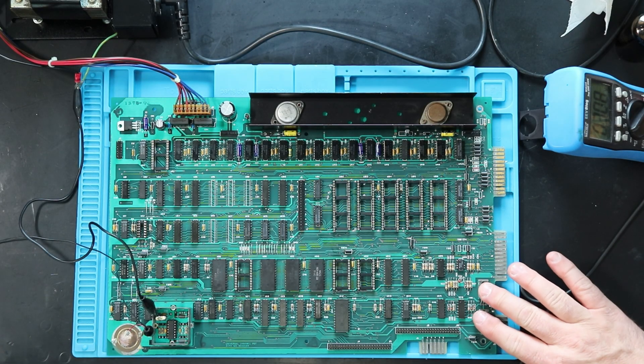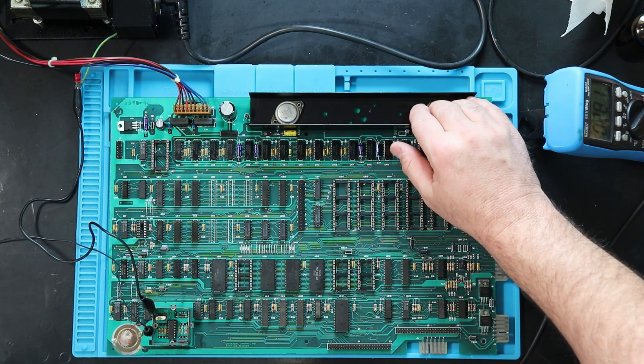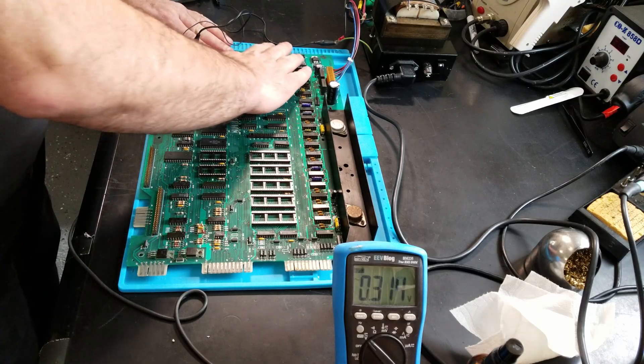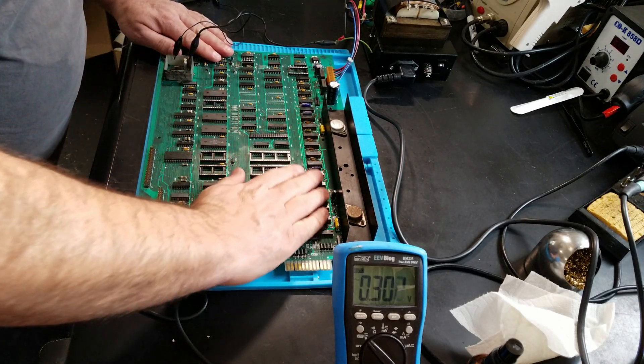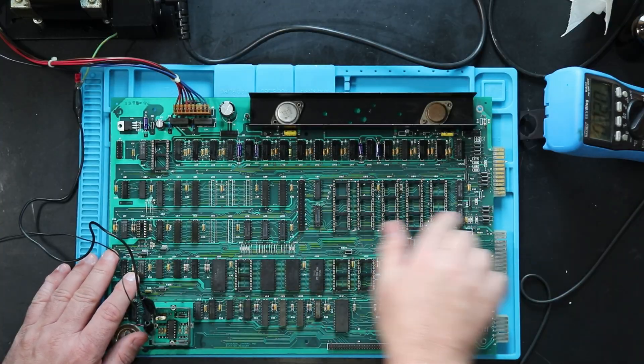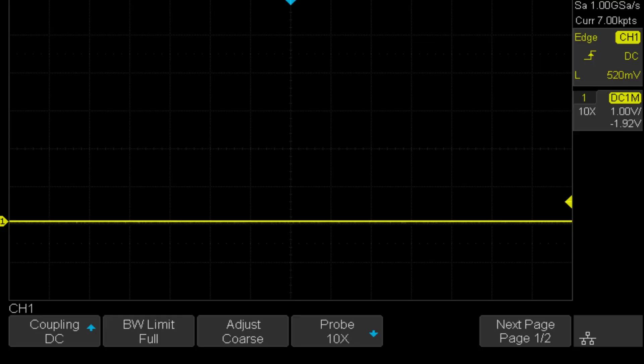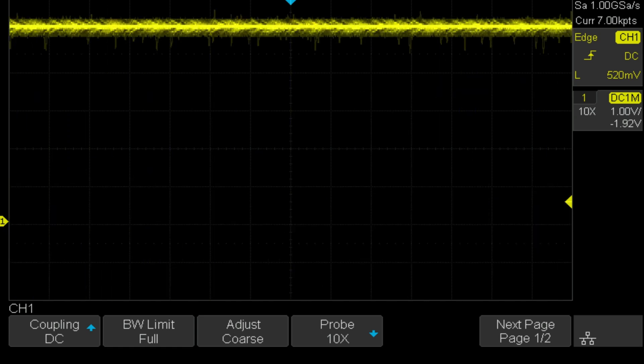This rusty old regulator is working — I've got one on order. I have some chips warm and some chips cold, but obviously nothing's going to happen until these get populated. So the next thing I always check is the reset circuit, and I don't like that.